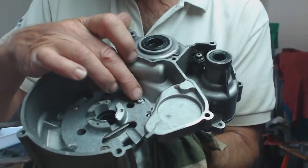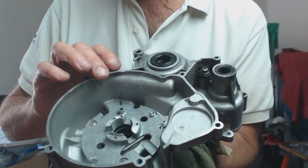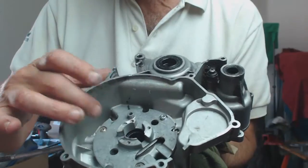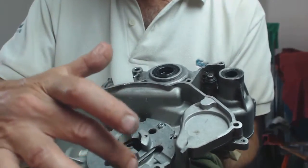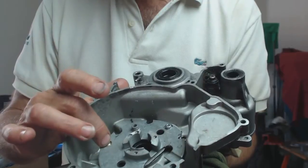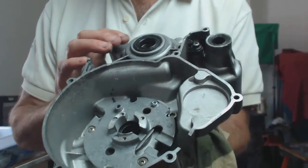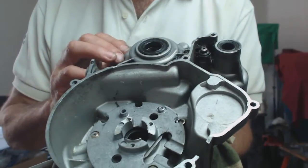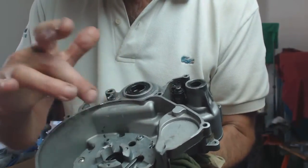Here's another one — you'll want to change these. When you get them off I would definitely consider changing them to a larger Allen screw, a hardened one, because these are soft and they're tiny — a two-and-a-half millimeter Allen key is what they take, and everybody struggles like hell to get them out. What you should do is heat them up and that will break the Loctite, and then they should come out much easier. That's a real key bit of knowledge, because if you don't, you will spin the Allen key in the screws and then you're down to drilling them out.